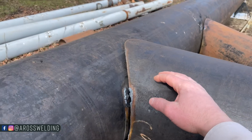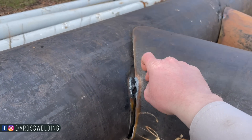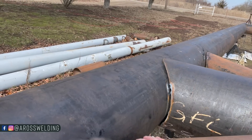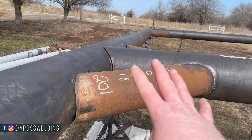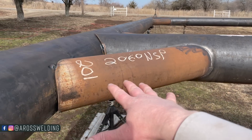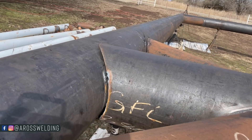I'm on top — safety reasons more or less. I cut these two bottom tacks, then this one, then this one. Whenever I cut the very last tack — which I think was this actual tack right here — that's when the whole thing moved away from this main upright. Some of it is because of the cold weather, but another reason is probably because of this thing sitting here and getting rain over the past couple weeks. We actually just got some last night. Everything kind of settles, so there was probably some pressure there, and whenever it finally got cut loose, it relaxed. Just pretty interesting and something to be aware of.